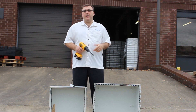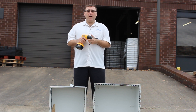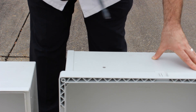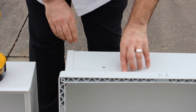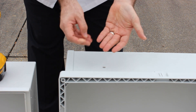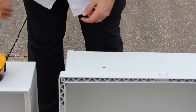The second easiest way, if you're just doing one or two holes, is you can use a drill. This is a twist bit for a small hole. Nice clean cut right there. You can see that there is some plastic debris, and that is normal. But you will notice that it's in large strands, and very little, if any, dust is here.